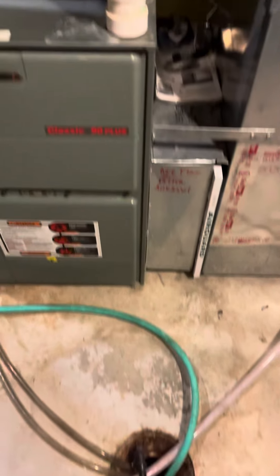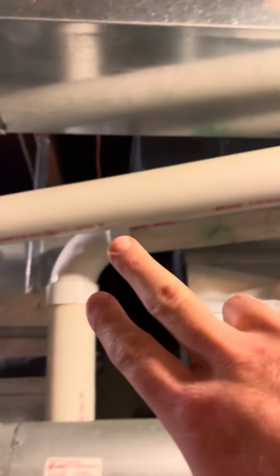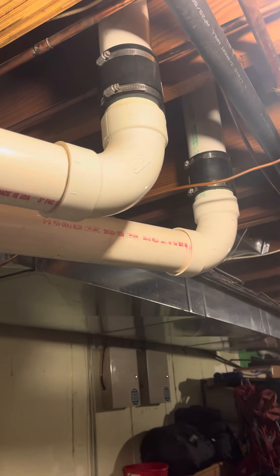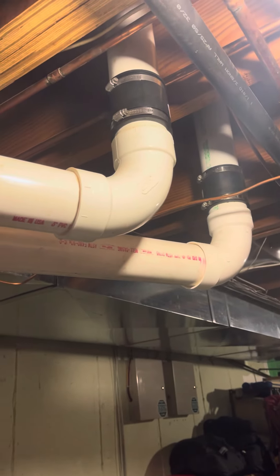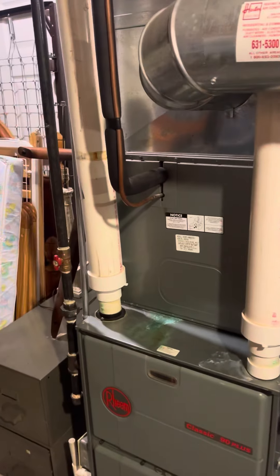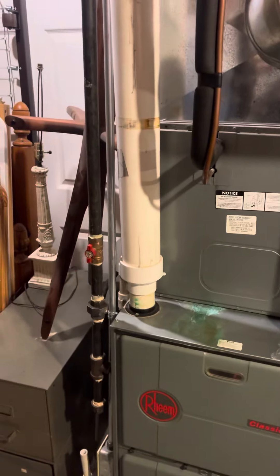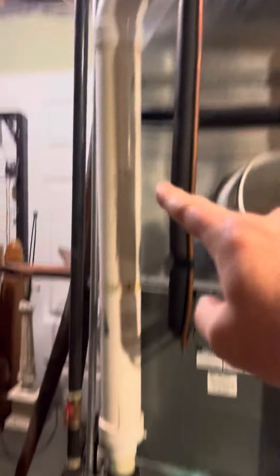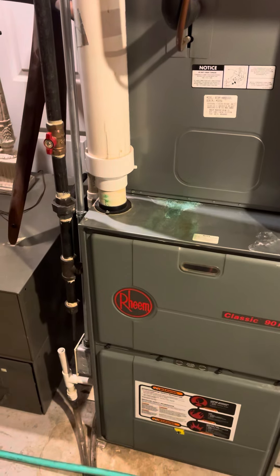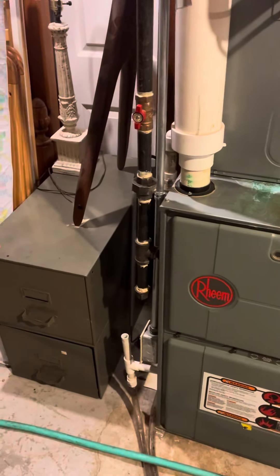Got your drains in front of you. PVC is two-pipe, three inch — I have a picture and I'll probably show you outside. They go straight up and out the roof and they don't 90 at all; they're just sitting right next to each other. There was a little bit of an issue with moisture that was coming back down into the inducer motor, so I'd like to be able to put some 90s on that up on the roof and separate that out.